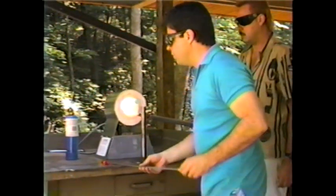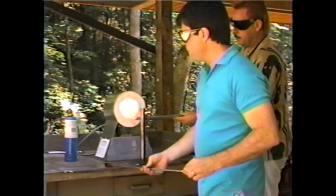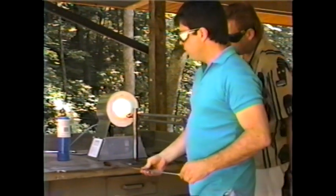Several things to remember. Glass works like an acid when it's hot. We want to avoid getting hot glass into the fire bucket itself. It'll dissolve the liner. If we do have pieces that chip and fall in, it's important to get those out. We also want to avoid touching the liner. It'll contaminate the glass we're working on.